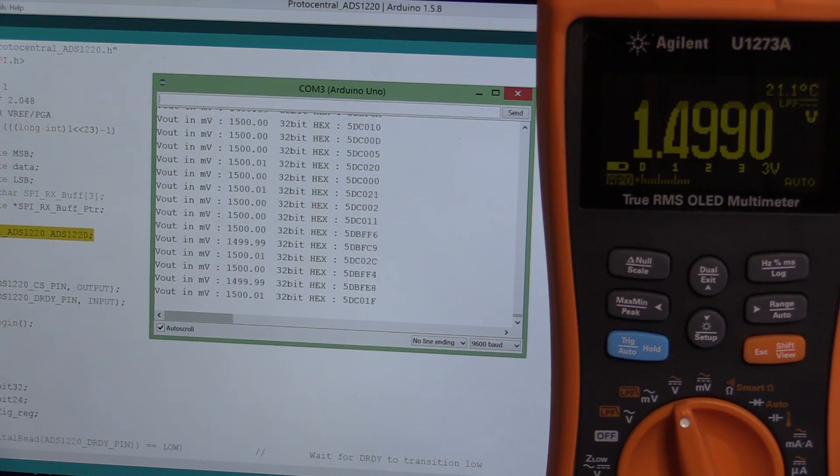So, looks like the chip didn't get destroyed in my messing around trying to hot air solder it onto the header and it seems to be working fine. I'm actually quite pleased that it worked first time. Let's go look at the DAC converter because obviously with our power supply, if we want to automate it, we want to be able to drive the outputs using the microcontroller — and that requires a digital to analog converter. You could use PWM, but then you'd have to have smoothing circuitry and various other things to convert it into a true analog signal. Using a relatively low cost 16-bit DAC — and in this case it's quad channel — you really only need two channels for this application but this one has four. 16-bits is still very accurate for a power supply. Let's go and see what we can do for software for that.